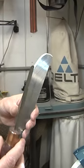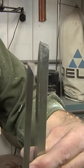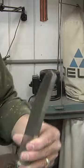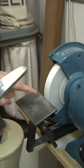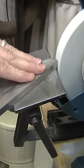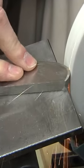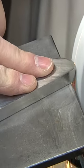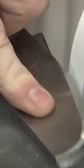With scrapers, I try to follow a procedure where I keep these angles all the same — they're all at about 90 degrees or so. The reason I do that is because I want to be able to come over to my sharpening system. I always leave this steady rest right here at the 90-degree angle, so I can just come up here, zip zip, and I'm done. You see how the sparks are coming over the tool? That shows that I'm all the way up to the edge, and that's putting a nice new edge on it.